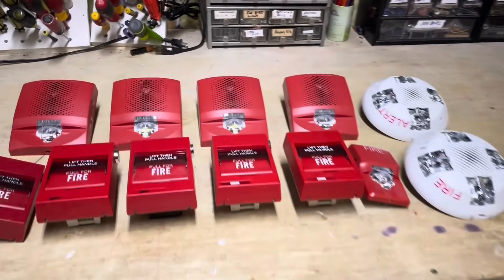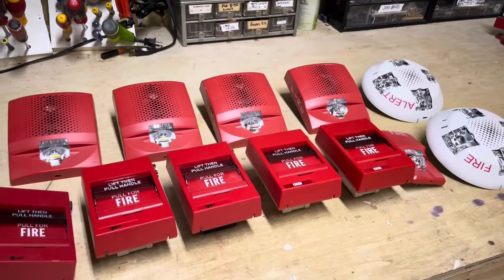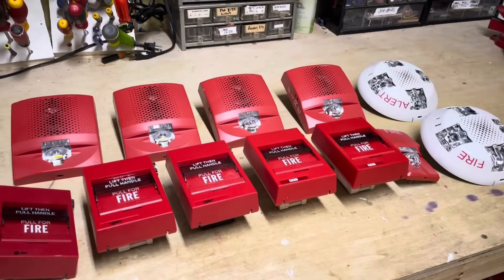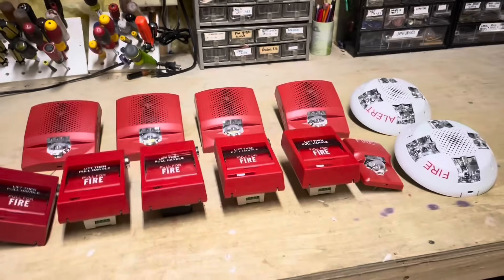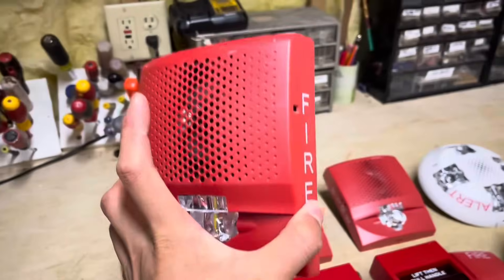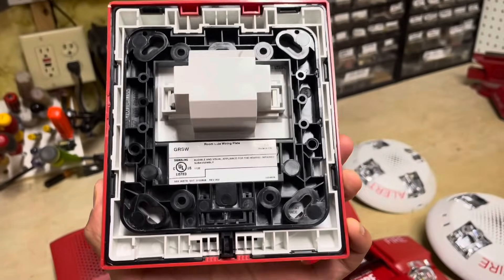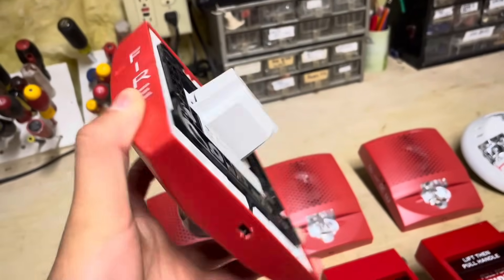Here's the new system that's going in, and very rarely do I get excited to put up a system because it's kind of just labor, but this is the system to get excited for. This is the newest line of LED appliances from Edwards. You can see these are LED strobes. I'm not sponsored, even though I'm saying good things — I genuinely just like the way these things look. If user-friendly was a fire alarm, that's what these things are. Look at this: you have a mounting plate that just goes on the wall, and then you plug the devices in. These things are small — when do you ever see a speaker strobe that's this small?